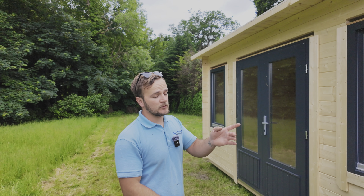Ben's set up the top pieces. We've got the gable pieces. This has got a flat roof going on it. If you have a little look round the side here, you can already see the slope of the roof starting to be put in. It's only a shallow pitch, which is all you need with a pent roof. Slight fall, water runs off to the back.